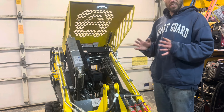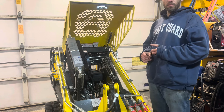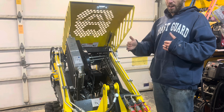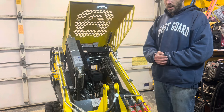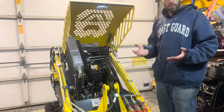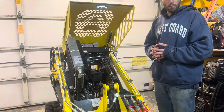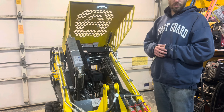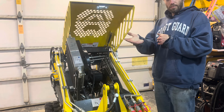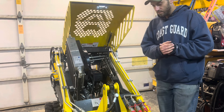So if you're doing any sort of movement you'll use up your fluid power moving the tracks and it won't be directed towards the attachment. Stick with a three-pump unit for high-flow work. Another big difference is the width — this one is right at 37 inches wide. Some are wider, some narrower. That's good or bad depending on your specific use. If you're lifting really heavy loads I'd go with a longer, wider one; if you're just messing around in the backyard it's fine.